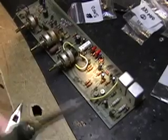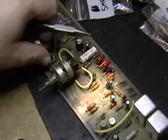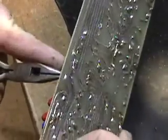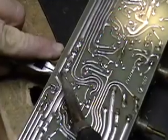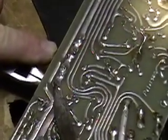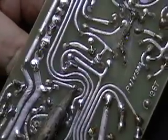Alright, one last capacitor to go. We've even changed the .22s. They're not in your kit, but someday they might be. They're usually not a problem, but this particular board was unusually filthy. And so therefore we're going to remove this 100 microfarad, and its plus is toward the center of the board.